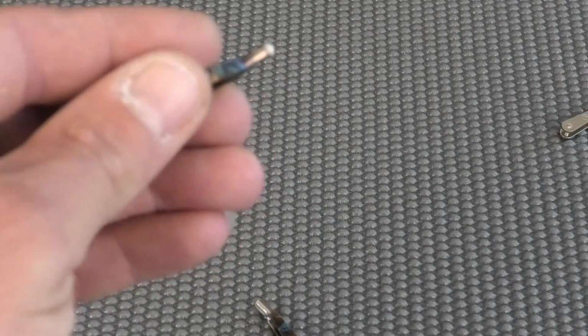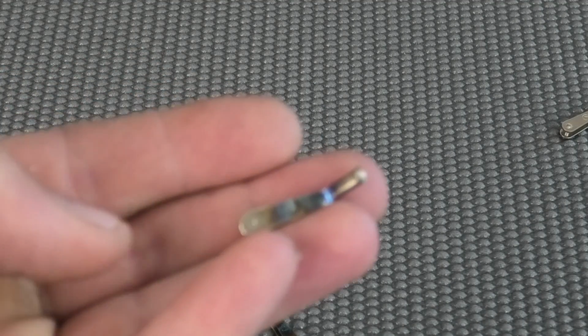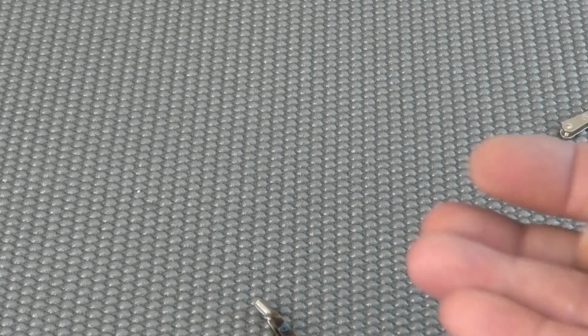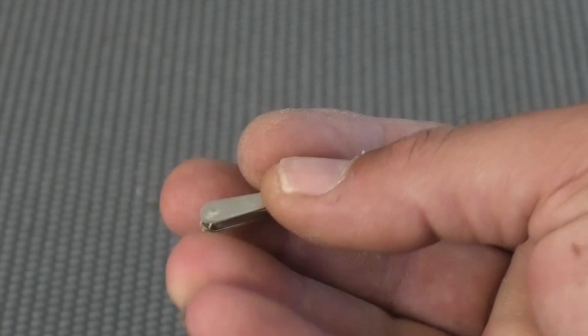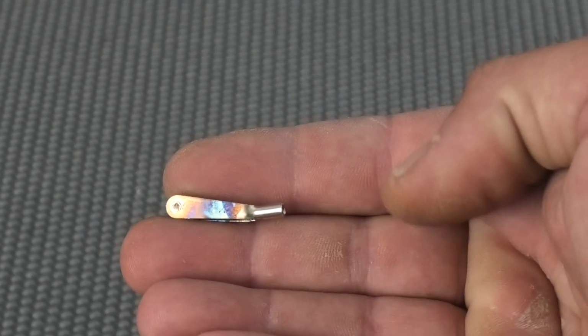Alright, well, as I mentioned before, we have to do some work on these Clevises, and what you basically have to do is bend them, and that's so you get enough clearance with the arms and the push rods to run very short servo arms. So this is what a normal Clevis looks like. See, it's basically straight. And this is what I've done with these Clevises.